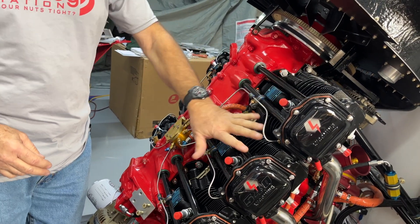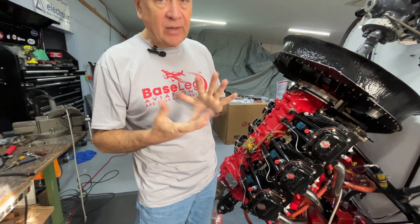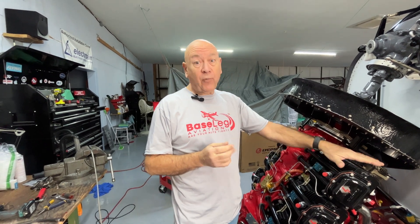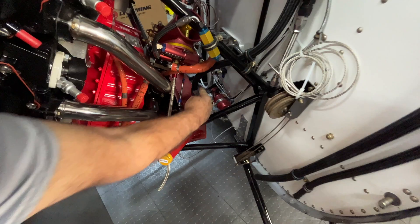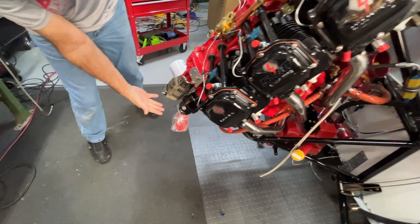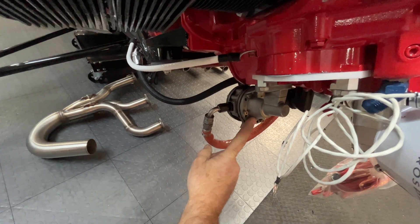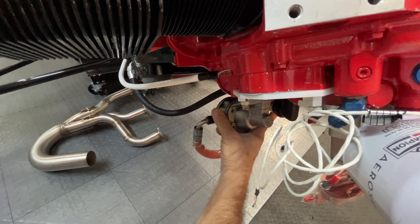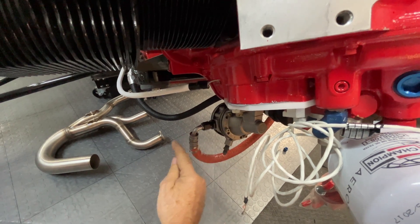With the proper injectors we can actually tweak individual cylinders by changing out the nozzle diameter in each injector unit, making it perfect for each cylinder — a really nice, smooth-running and temperature-controlled engine. A carburetor will work on pressures of about four to five psi, actually down to about half a psi and up to about eight psi — we don't want to unseat the float with too much pressure. Injection systems require a much different setup: typically 14 to 30 psi. So we have a higher-pressure fuel pump; you can see that right there going out to the engine-driven pump on this side. This diaphragm pump can be used for both carbureted and injected engines — just a different pump physically. In this case it's putting out around 27 psi for the injected system.